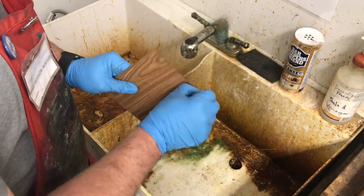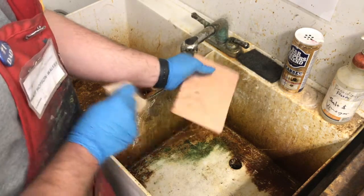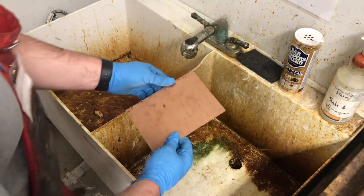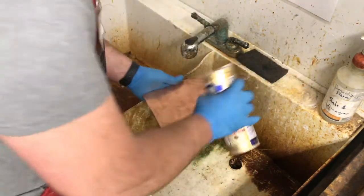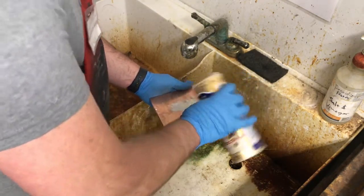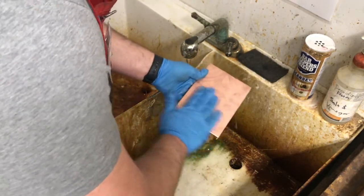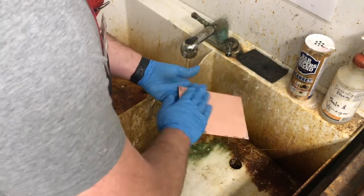So I'm done with the process of it being in the acid. That shelving paper should go in the water-based waste because it's been in the ferric. Might have some residue on it. And then I'm going to follow the degrease and deoxidize procedures. So I want to go ahead and degrease with a little bit of Barkeeper's Friend or Bonami. And I like to do both sides of the plate at this point.